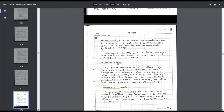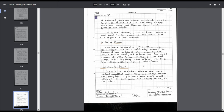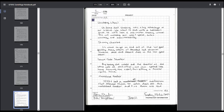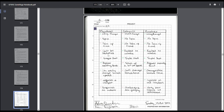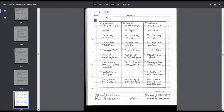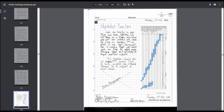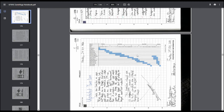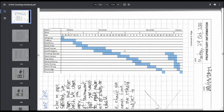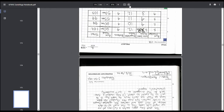The Haunted Tournament Reflection was essentially us saying we hate the old robot and listing everything we wanted to do differently — time for a rebuild. We knew we needed a 6-motor drive because we were getting bullied as a 4-motor drive. We listed every single thing we wanted to change and did a compare and contrast between all the launchers — punch, catapult, flywheel — though we probably should have done a decision matrix. Then Gantt Charts: Gantt charts are something you should really have in your engineering notebook. Gantt charts are way better than timelines. That's a huge number of points you can earn on the engineering notebook rubric.